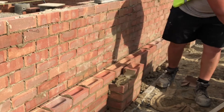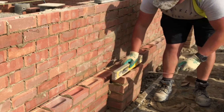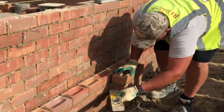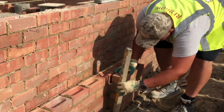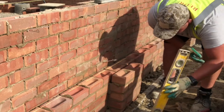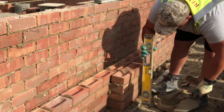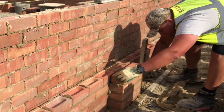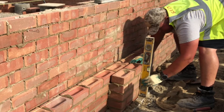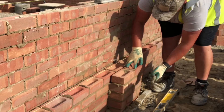I'm enjoying the hot weather — it just makes work enjoyable. I did have sun shades on today. My eyesight isn't the best so shades inhibit me seeing the work — I'll try wearing them on blockwork and use them when backing the footings. I also ordered a big 30-metre tape measure to check measurements against the drawings, checking where door openings are. At this development the door openings are set back about 20-odd mil, which I need to check on the spec — I've had to do remedial work altering door openings where the brickwork wasn't set back enough.